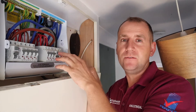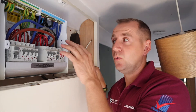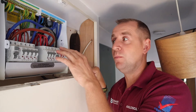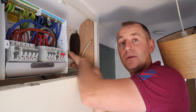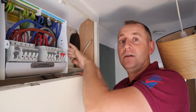One thing I've noticed inside this consumer unit is that the live and neutral conductors on the meter tails are not identified, so I'll identify those. Also, I can see that all the circuits inside this house are running in the cavity of the wall behind this consumer unit, so I'm not going to drill in this consumer unit — I'm going to drill to the side where there's some space, and then gland my EV ultra cable into the side.